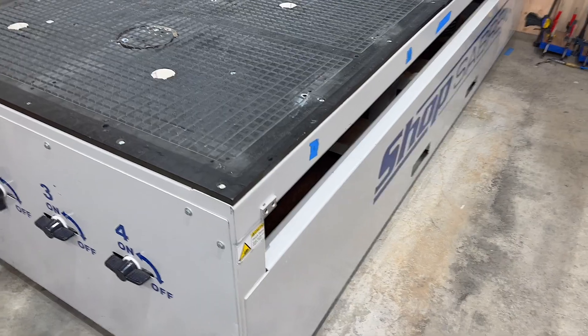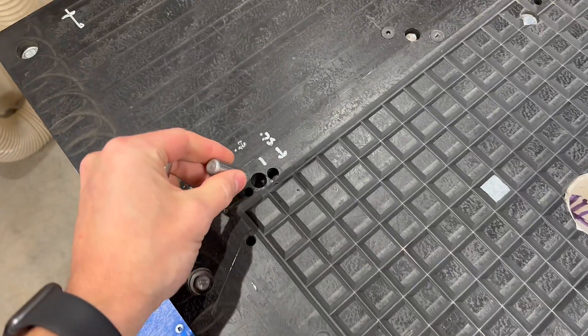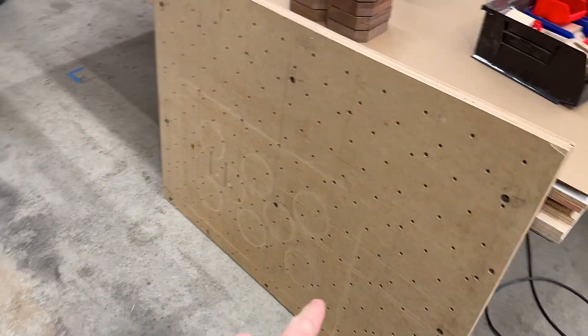Or we use this fixture plate we've made, which I'll show you now. One of the keys to being able to repeat a setup is putting in some type of alignment pins. We use steel pins — you can also use acetal ones. We drilled a slightly larger hole in the phenolic so the fixture aligns in the same spot every time — one pin here, one there.